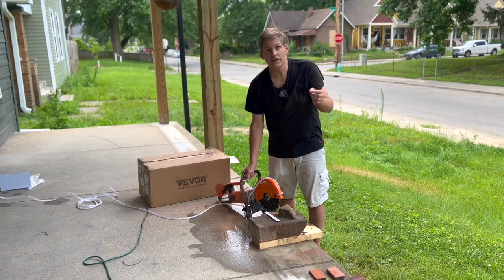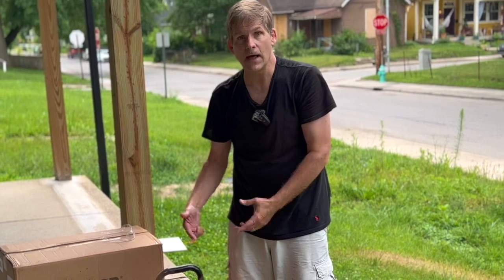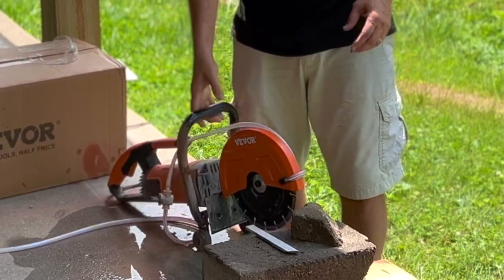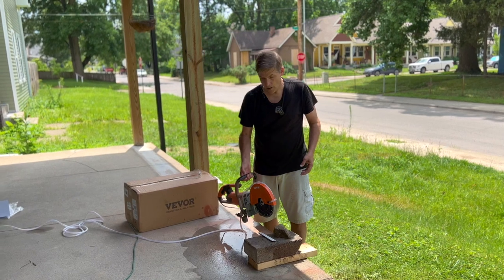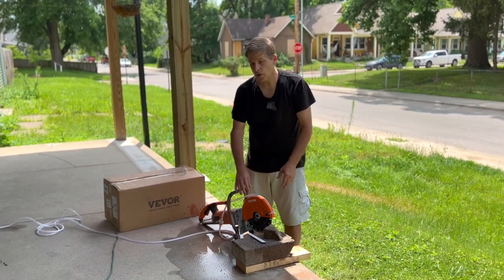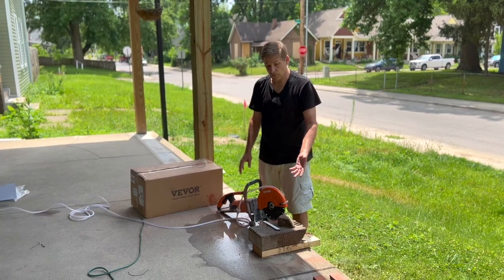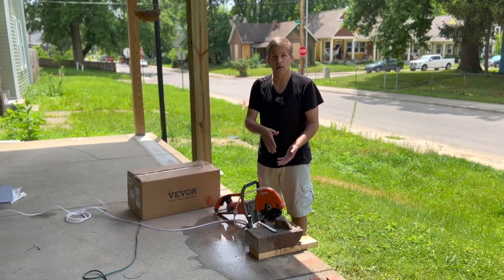If you're interested in the saw, check out our Amazon affiliate link in the description below this video. One disadvantage is you're tied to your project with an electric cord — if this was battery powered, that would be a dream. Another con might be the pump; that pump was kind of acting a little funny. It's a little micro pump, like a pond pump — those kinds of things are a dime a dozen, and if that were to ever go out, the saw itself is pretty sturdy. It's not a pro or a con in that it's heavy, but it's not near as heavy as a full blown 14 inch gas powered concrete saw, though it's a little bit of a lift and you'll get a good arm workout over the day. The pros: I love having something that's a compact saw, gives you water, and cuts down on the dust. You want to make sure that your material is not more than seven inches thick, and if it's more than three and a half inches thick, you've got to flip your material and cut on both sides to get all the way through it.